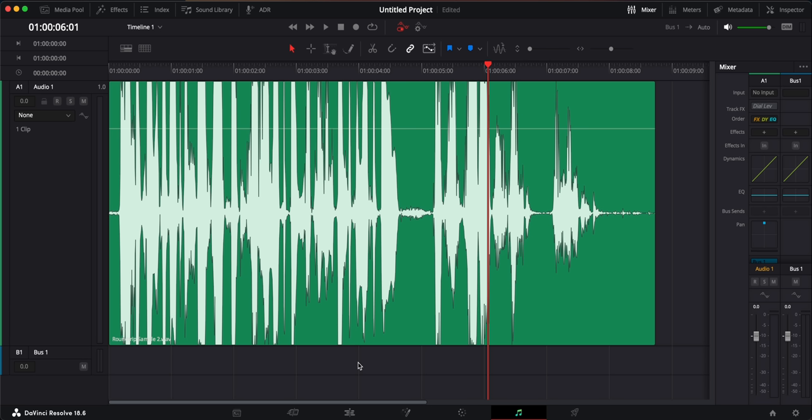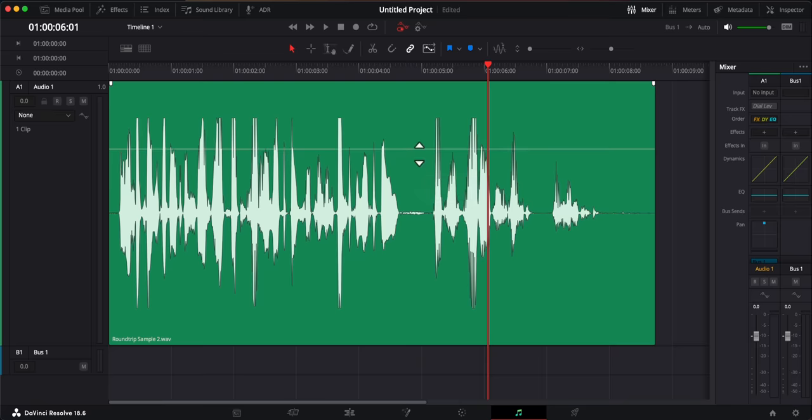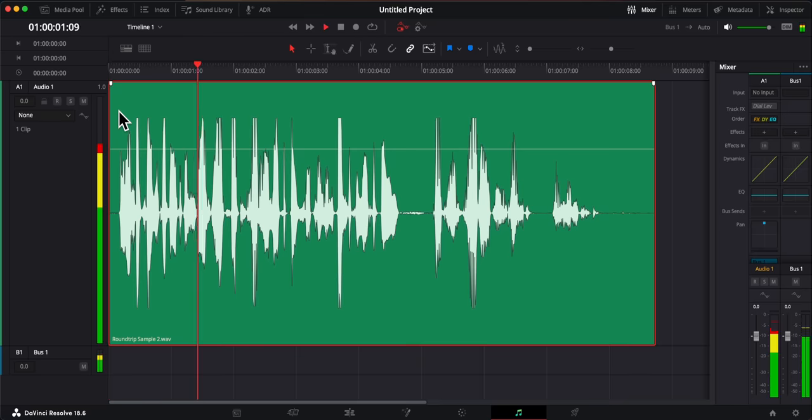Normally on a wireless microphone system, if you set the input level too high, and it goes above 0 dB, it will clip and it will sound very, very distorted and it will be unrecoverable. In this case, with a 32-bit float wide dynamic range recording, you can usually go into your digital audio workstation or even your video editing app and pull those levels down so they're no longer clipped and distorted.